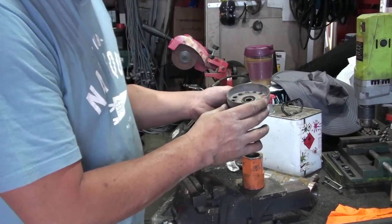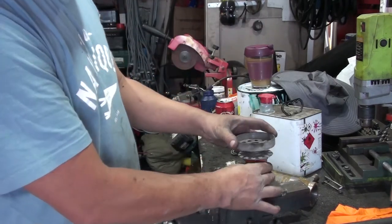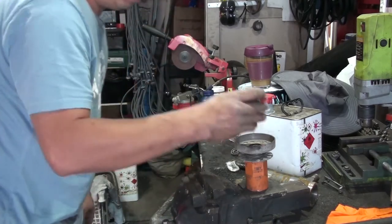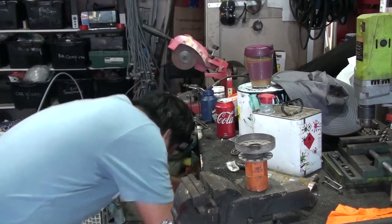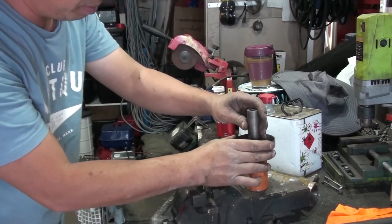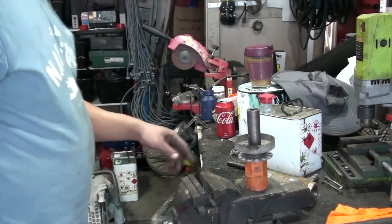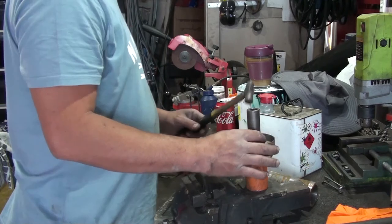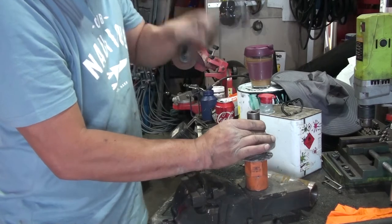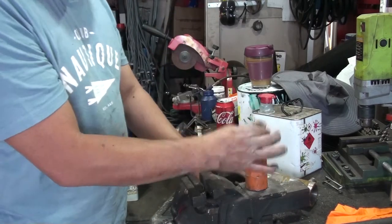Okay, we're going to knock this out. So it's big side, small side. We put the big side down, and then we knock it down with anything that can go in there. Don't worry. Otherwise you damage the bigger bearing, because this side is not really okay. Where's my big hammer? Okay, no big hammer, a small hammer. That will do.